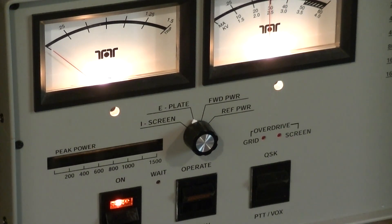We've got five-thousand-hour filter capacitors in it. The tube is extremely robust — it's not drawing any screen current at all. It's a heck of an amplifier. I'm going to use it to run the swap net today; gotta crank the output down and get that adjusted now.